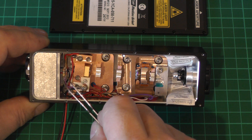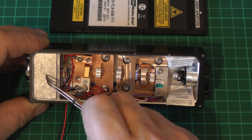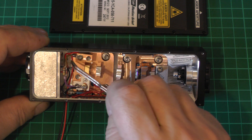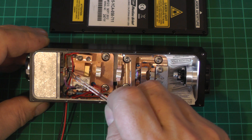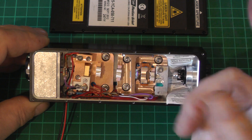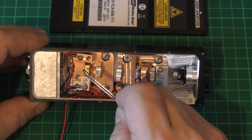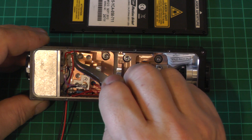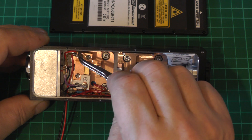When I first opened and tested this laser it read dead short across the laser diode, because there's a relay in the back of the head which actually shorts out the laser diode when it's not in use. What I've done is soldered a 100 ohm resistor across the laser diode to help prevent ESD damage, and I've also got a small 1N4148 diode soldered across as well to catch any negative-going transients. Laser diodes are very sensitive devices, and the higher power they are the more sensitive they are to static discharge. The old wires going into the back I've put heat shrink tubing over the ends and tucked them in behind the laser diode block.